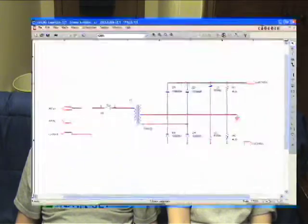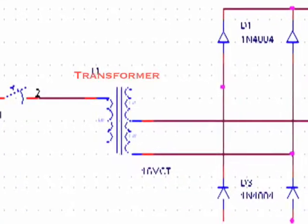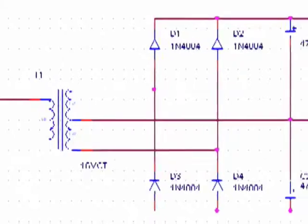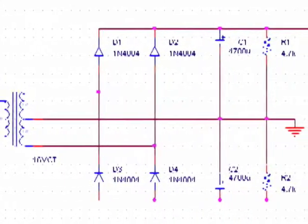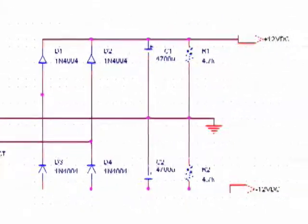How does it work? Our basic model for our power supply is going to be a fuse and a switch hooked to a line from the wall, which we will then hook to a transformer for our primary circuit. Our secondary circuit will consist of a bridge rectifier and a series of filter capacitors to help smooth out the DC voltage pulsations. We will also add resistors in parallel with the large filter capacitors to help drain them of energy when you switch the power supply off so no one gets an accidental shock. And for good measure, we will add a power on/off LED so we know when it is actually on.